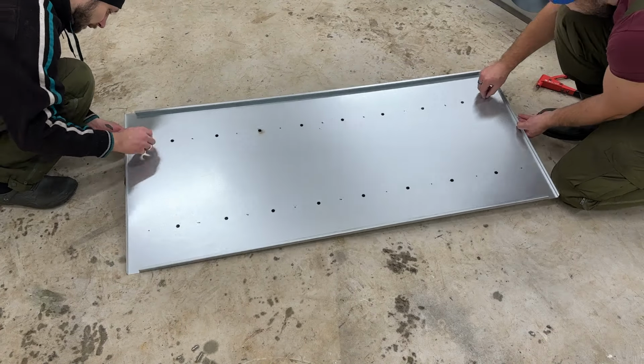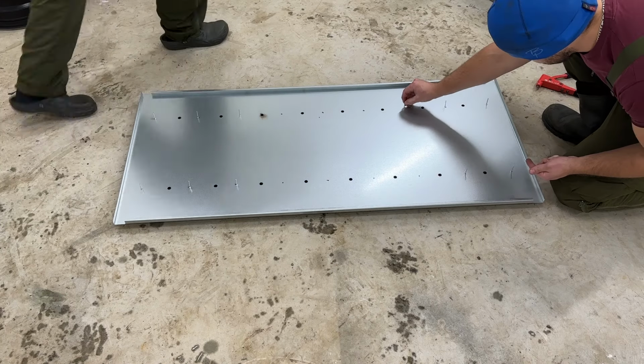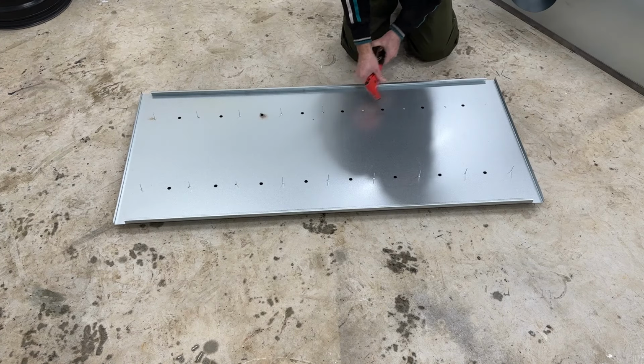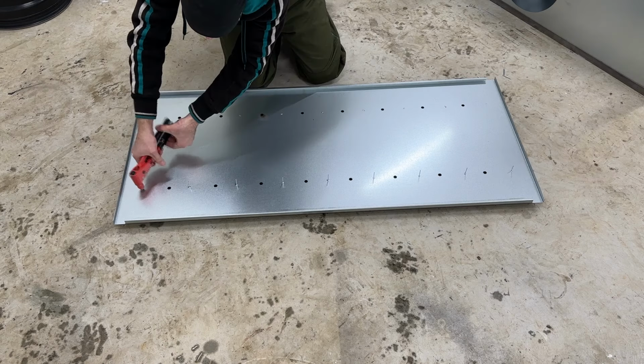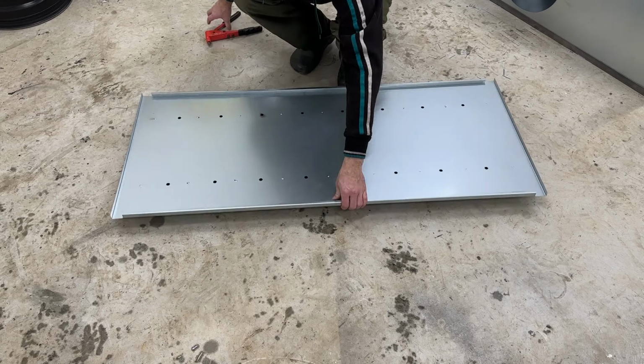Here we assemble the detachable roof. It is made from one bent sheet metal panel and 2 square tubes riveted together. There are also hex holes. These are for rivet nuts. If I want to attach some hooks or other hanging methods, I will need threads.